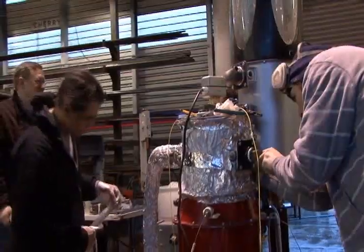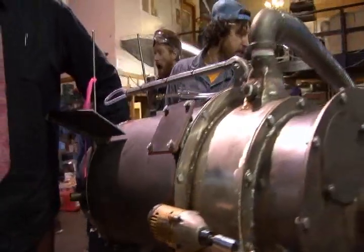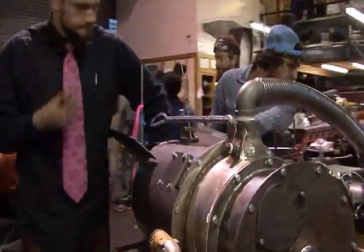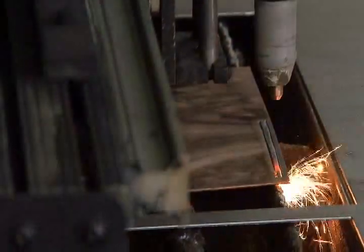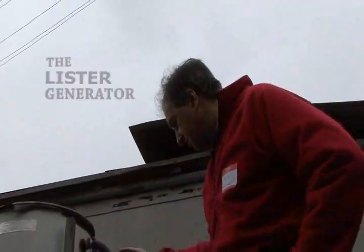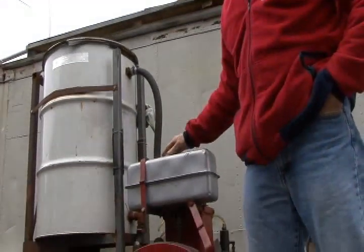So a gasifier is putting together these four processes in various sorts of orders and forms. Four processes, again, being drying, pyrolysis, combustion, and reduction. So these are still made in India. There are several manufacturers of these. This one is made by a company called J. Kaysen. They are one of the better in terms of quality.